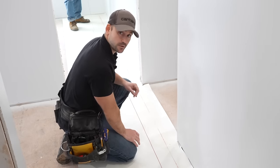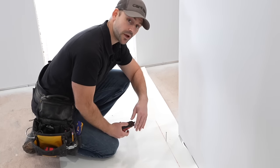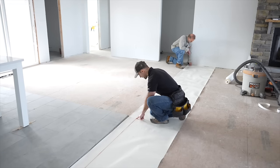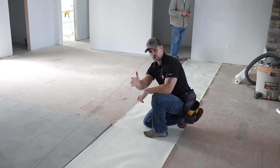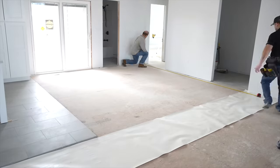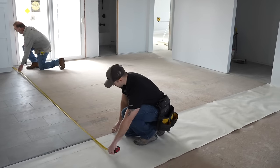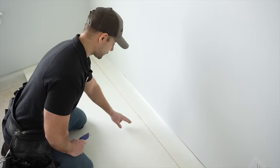I now take a hammer and nail and place it right on the mark we just held the chalk line on, then hook my chalk line and run it the other way, extending it past the tile. I snap this side and the line is running straight down the hall to the farthest room, clear out past the dining room. To double-check we're running square with the dining room, we check corner to corner up that chalk line — we got 14 foot 1/8 inch on both ends, so we know that string line is running square, which is very important when doing a whole house.